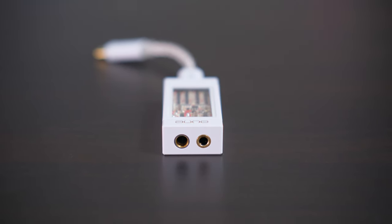What this deck does have is two analog outputs. One is single-ended 3.5mm, the other is balanced 4.4mm Pentaconn, and this one is truly balanced, which means it has almost twice the power of the single-ended output. A balanced connection uses two signals — positive and negative — instead of just one, so they can use double the amplifiers. If you can utilize that balanced output, use it — it will sound slightly better and have slightly more power and control.